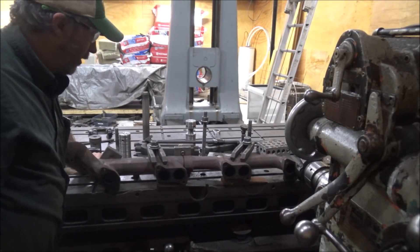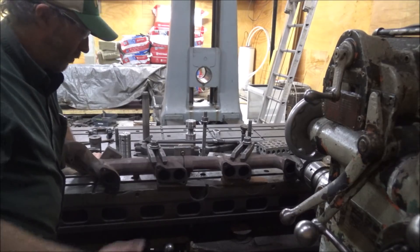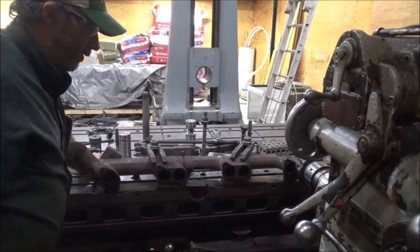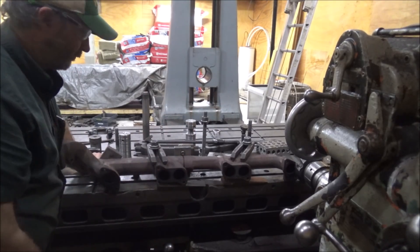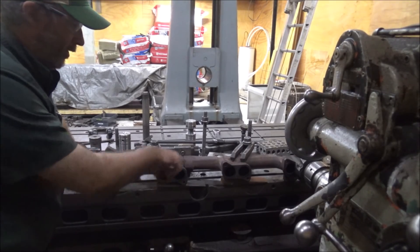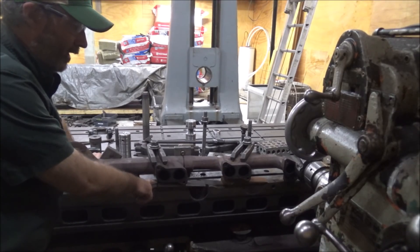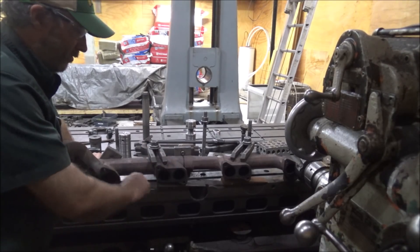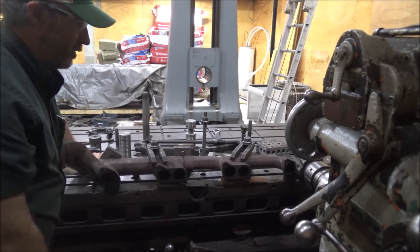You've done it yourself, so just indicate it for straight and square to the column and mill this all flat. That's all looking to do here. Just need to get these faces lined up with that cutter. So what I'm gonna do this time, I'm using wedges underneath these flanges here. I can tap the wedges to make this tip one way or another. Wedges are great for irregular surfaces such as these raw castings because you can easily make up the height. You just tap and get it where you want it to be and then lock it down.